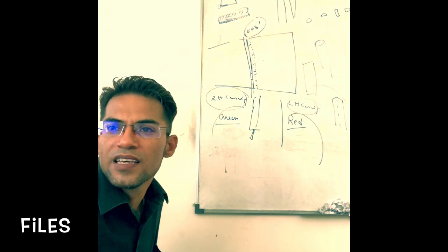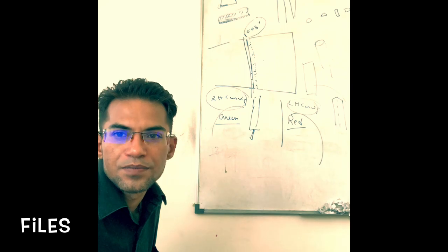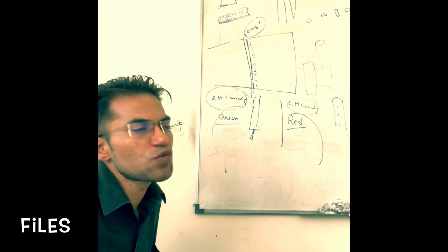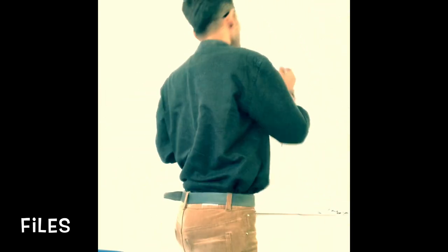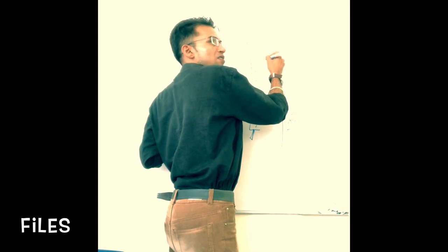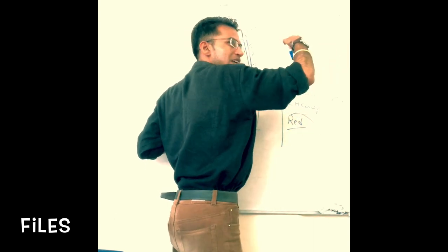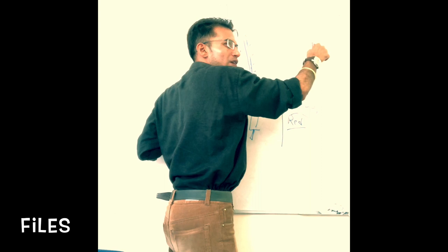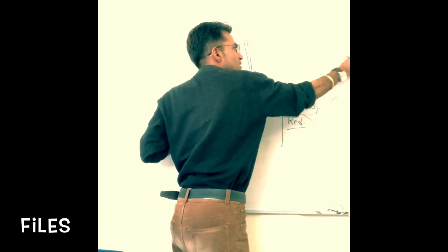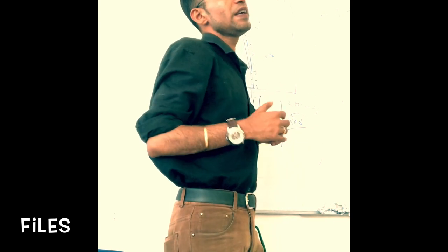The round section is used in association with a bellied, parallel or tapered blade, and the most commonly used is bellied. They are used for filing small radius. We drill out a hole and then we need to file it, because we need to clean off these burrs and make it smooth. Quite naturally, a square, rectangular, or triangular file won't move inside, isn't it? So what I need is a circular file to finish off the radius.